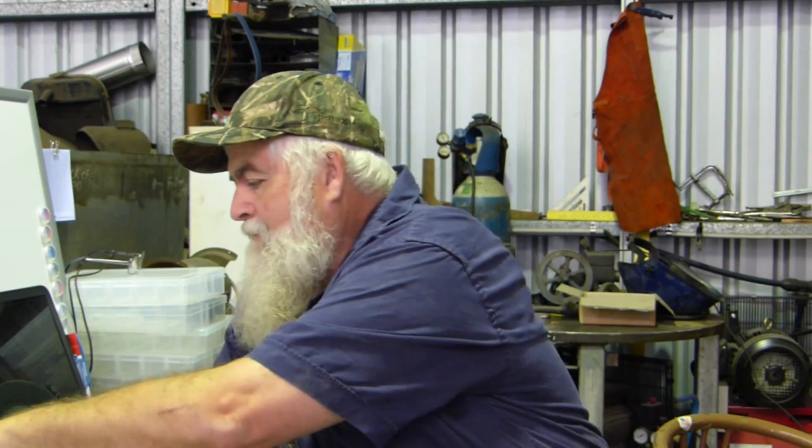I also bought, for these insert groove cutters, would you believe, three packets of 10 inserts. They're tiny little blokes, and these fit one of my other parting tools. I've got two small grooving and parting tools, and they fit them too. Usually with parting and grooving you're not feeding big heaps, you're just going in taking a little peck, so these cheap ones seem good. 30 inserts for $38 delivered to Australia. That's a good thing.